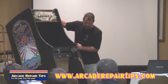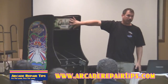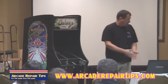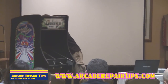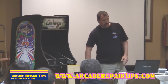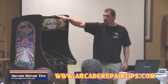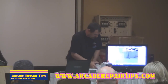You can get all the external parts — coin door and everything — pretty much online. You can find parts at the shop, swap meets, or whatever. Those parts are still available. For your coin door — I don't have one here, but you put the coin door on, take the brackets off, use a rotary wire brush to get all the rust off, get them real smooth, and then use a rubber sander.